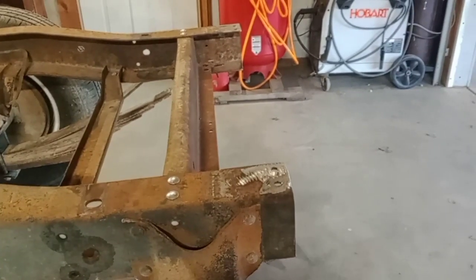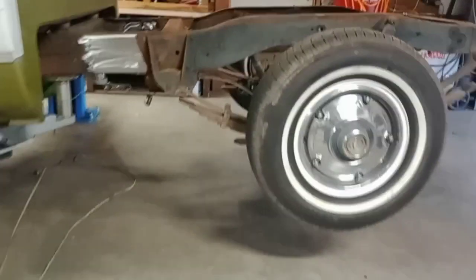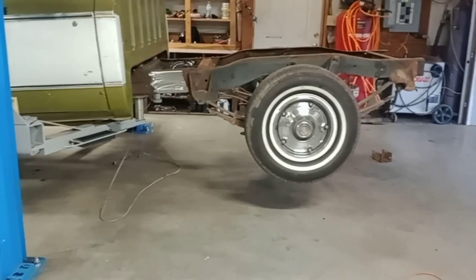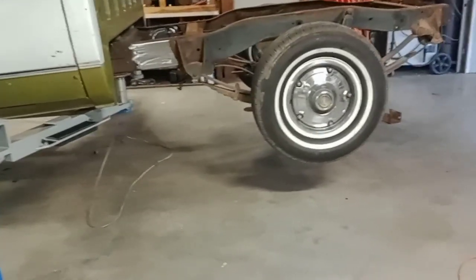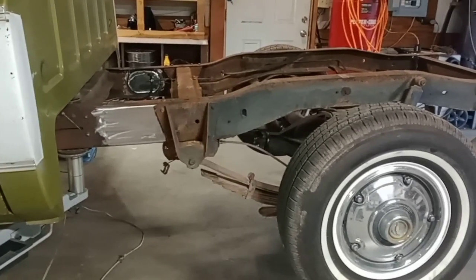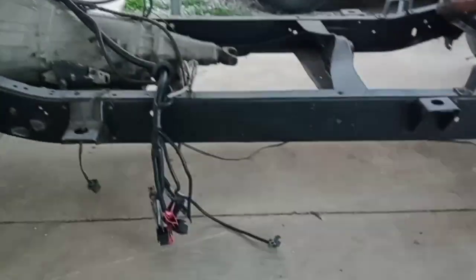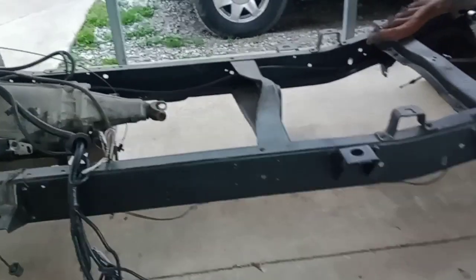Here's the back — used anchor bolts on those, did the back brace, got the back cut off at six inches or five and three-quarter. I did this truck in a matter of a day and they look a lot shorter as a short bed, they really do. Stick with Z cuts. This is the 14 inches up front with six-inch overlap — only for '73 to '87. On '67 to '72, I take 12 out of those frames and they come back together.